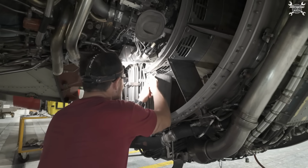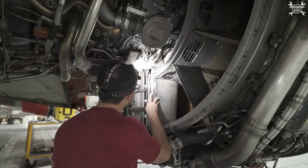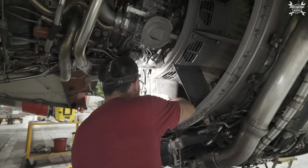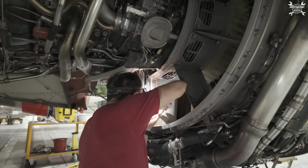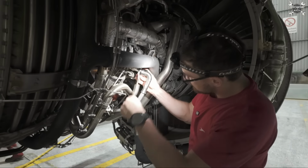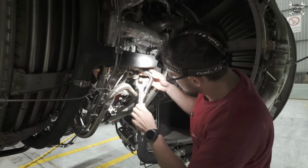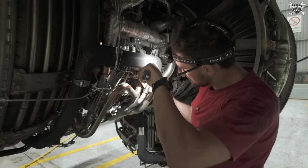And since the igniter lead is in place, I need to install the cover. But before that, I'll remove old sealant from the structure and from the panel. Then we'll place the panel in place, screw it on the position, and of course we'll apply new sealant. Now basically all that's remaining is just to install the igniter lead on the igniter plug and to the ignition unit. And then we need to test it, of course.